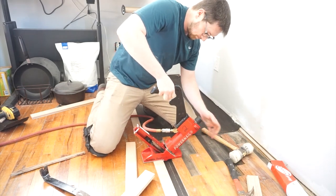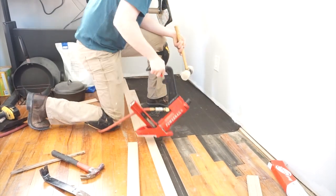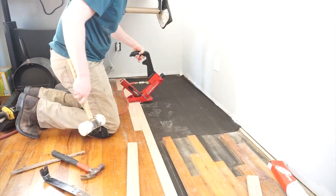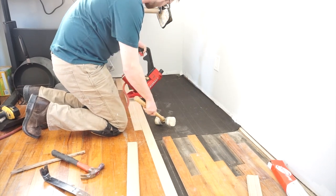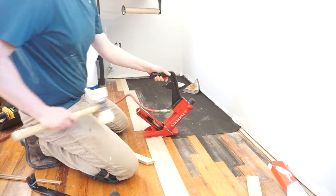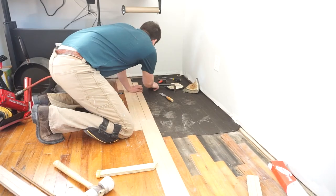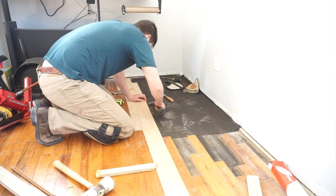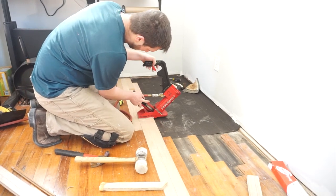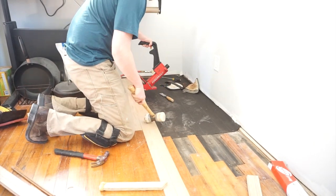For this style of flooring I put my nails in about every six inches. If I couldn't get all the way down a piece because an adjacent piece of flooring was blocking it, then I put in surface nails — such as brads or finish nails — and covered them with wood putty. One thing I ran into, and you might as well, is that the spacing on old flooring might be different than what you can do with new flooring. I could put my new flooring in much tighter than the existing flooring actually was, and that started throwing my lines off as I got closer to the wall. What I did was manipulate and re-nail the ends of the existing flooring to be closer to the new flooring spacing.